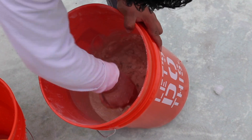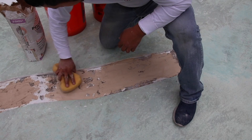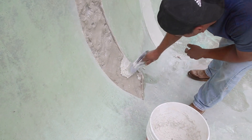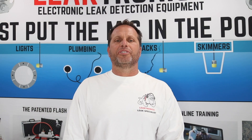Next we take a hydraulic cement mixed with a little bit of grout and fill everything in, because now we have depth and coverage. Then you can see how we use our plaster and do a plaster patch. Remember, this pool is all stained from the green from the heater and copper, but this will eventually green out as well.